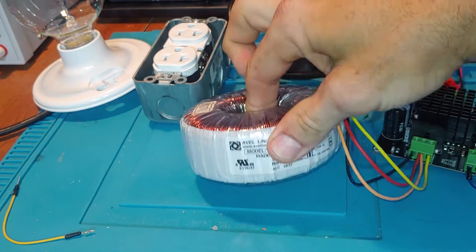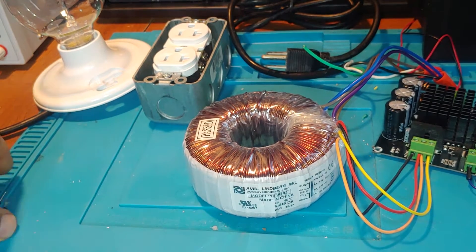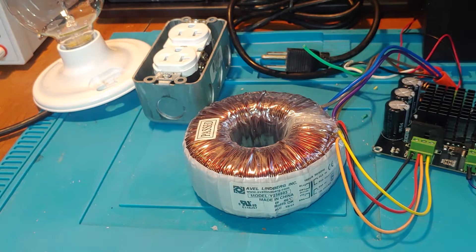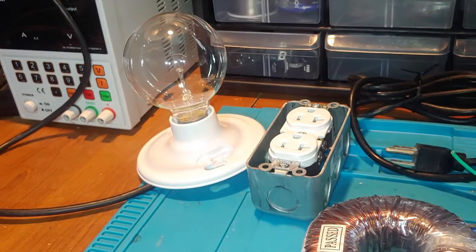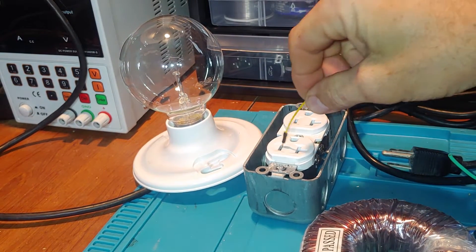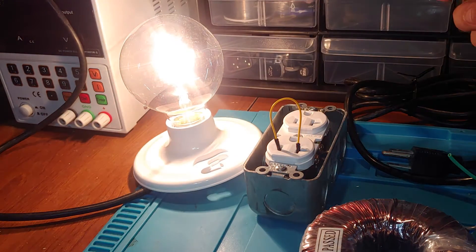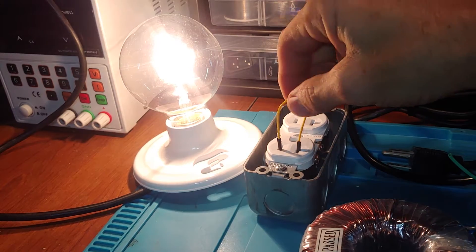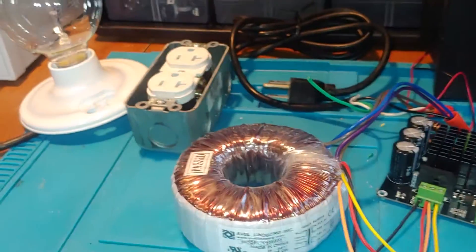So you get these AC transformers that have dual secondary windings. The first thing is I'm just testing this out — I'm not actually creating this, so I'm not using a fuse. But what I do the first time with all these is I use this small light bulb tester, which can just detect shorts. So you can see if it comes on — if I'm miswired somewhere in here, that will come on.